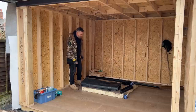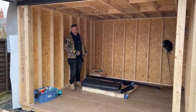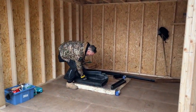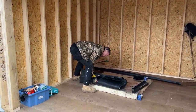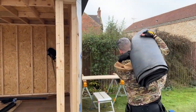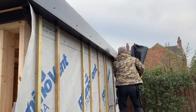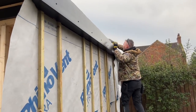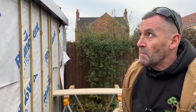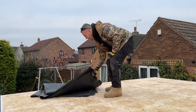The roof's clean now, all brushed off, nice and smooth. I'm ready to go. I've got my rubber — if you've ordered it online it'll probably come as a really tight little taped up ball and there are loads of creases in it. In the summertime you put it on your roof and a couple of hours later the creases will be gone, but this time of year they're not going to come out because it is cold. I'm going to get the rubber up — it's a bit of a bugger to lift on your own, so it is actually better if it's taped up into some kind of ball.